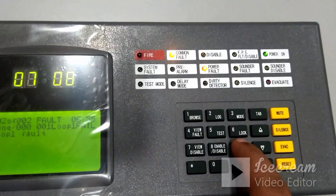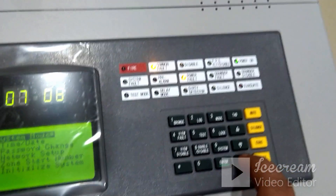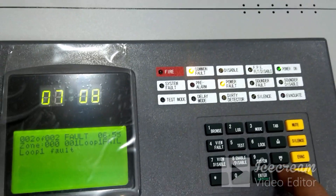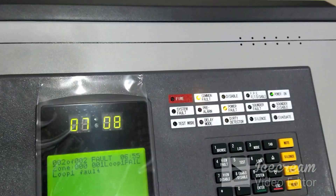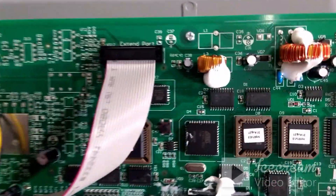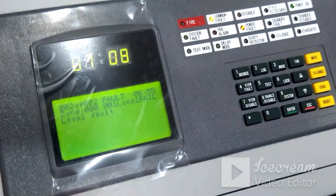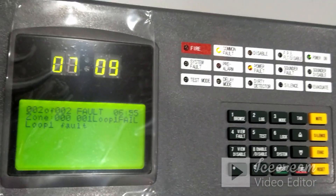The first step is to check the address. Next, come to the repeater panel side first and press the System button. It will ask for the password — normally the password is 24220011 — click Enter and open the repeater panel. On the repeater panel side there is a button called SK1. Press and release the SK1 button so that the repeater will start to auto learn.